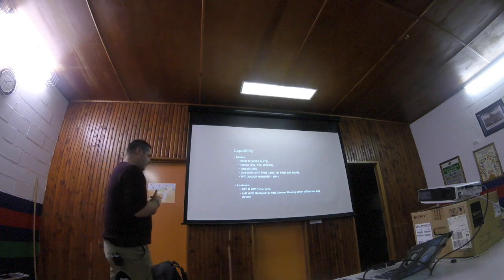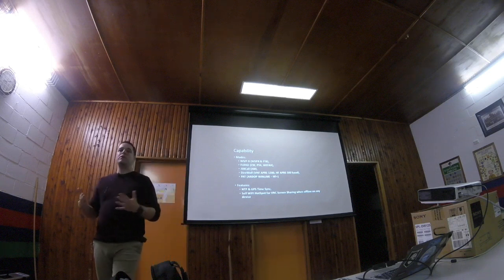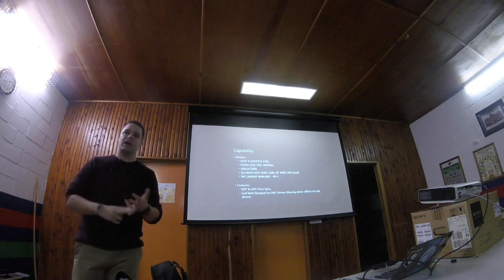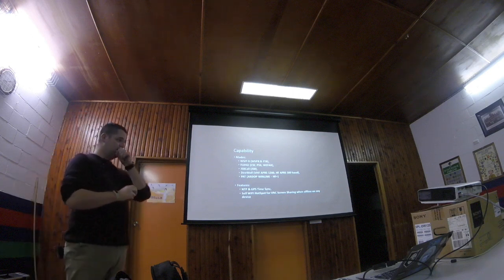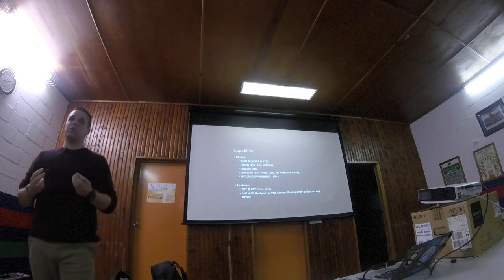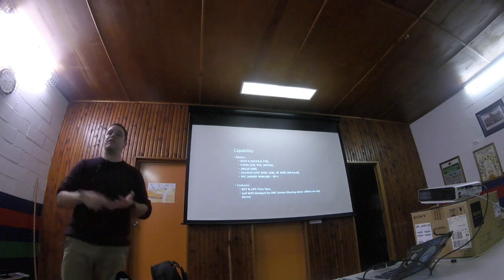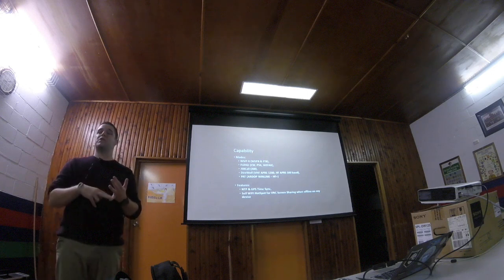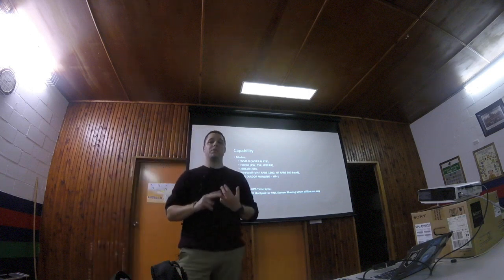For some of the time-dependent modes, such as FT8, JS8, and some of the other JT modes, time is incredibly important on your computer. So you're often told that you need to sync the time or your time's out of sync. It affects your ability to decode transmissions, but it also affects the ability for other people to decode your transmissions.